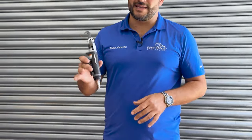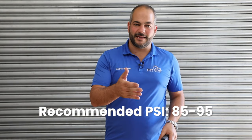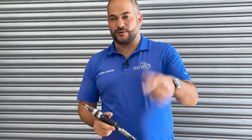One thing to keep in mind for this tool, and actually any other pneumatic tool — any tool that's dependent on air — you have to make sure you get the air pressure set correctly or else the tool will not work properly, and you'll also start blowing out gaskets. A lot of people will complain that the tool broke down, but in reality they're putting too much pressure on it. The recommended PSI for this tool is 90. You don't have to be perfectly at 90 — you can be at 80, 85, 95, 100 — but if you start running at like 150 PSI, the gaskets are probably not made for that. You're probably going to blow it out and ruin the tool a lot earlier than you should. Also, just like any other pneumatic tool, drop oil down it every day so it doesn't rust. Our air compressors generate water condensation as they run and you don't want that water going into the tool.